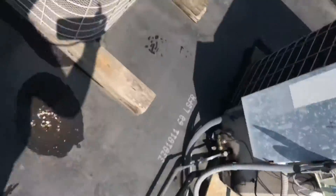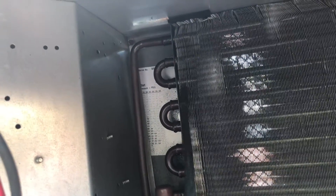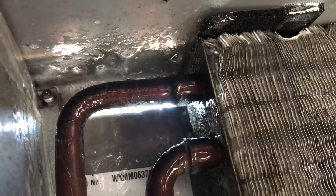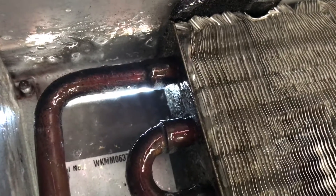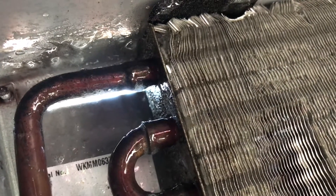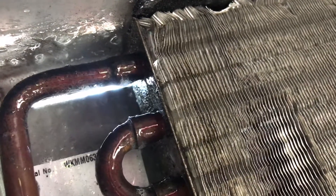You can hear it just going right off. You can see the bubbles coming down. It looks like the very top, right on that tube sheet of this coil — right where the pipe basically goes through the steel there. We're going to have to get in there, pull away the fins a little bit and try to figure out if we can fix that.